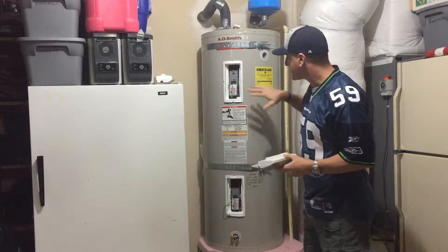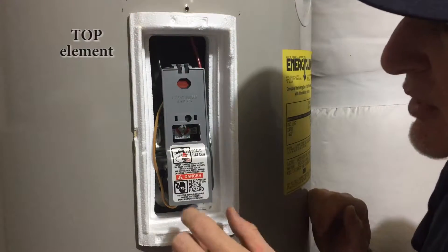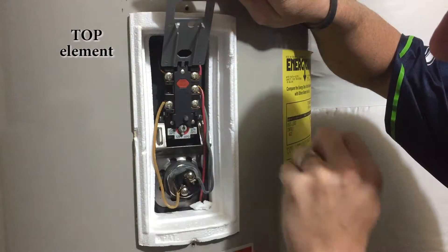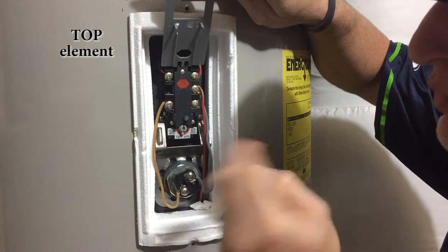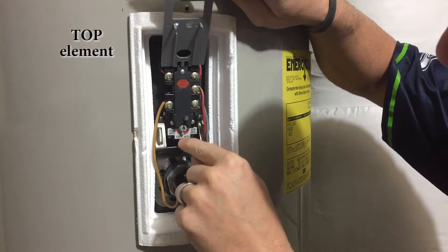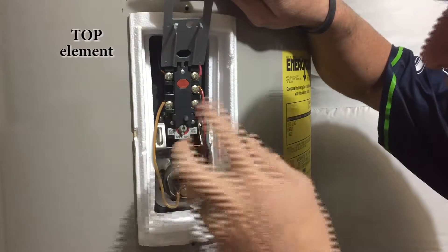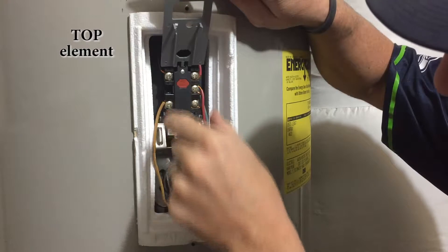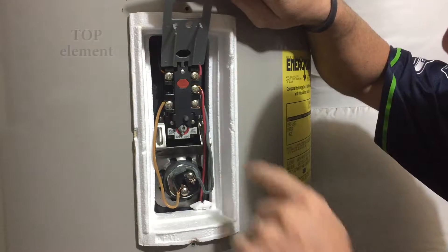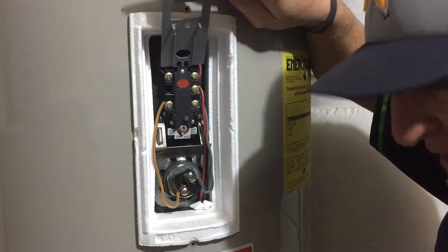Now that we've got it open, we can access this. Realize this is high voltage coming in through the top legs here. The legs come in the top here and those are hot — those should be 220. You're going to test those with your voltmeter while we have power. Then it goes down to the other leg into the thermostat. This will trip when it gets to 125 degrees — it will turn on if it's below that and turn off if it's above that. That's a switch on and off, and these two then continue down to your element and put power into the element that heats the water from the top of the water heater. Obviously if you reset, that would click if it was actually popping, which mine was doing — I'll show you that at the bottom.